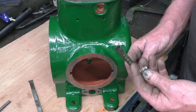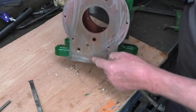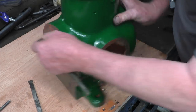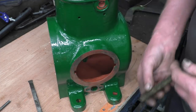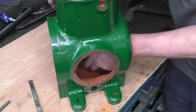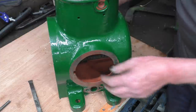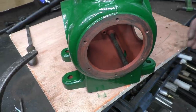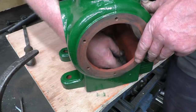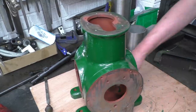This is one of the last parts out and it's only one of the first parts back in — it's the actual oil strainer. It goes along the bottom of the crankcase and connects with that port there, and that's where the oil is pulled into the oil pump. It's spring loaded, one end's blanked off and it's got gauze all the way through it. Spring loaded up against that union — that's the oil feed pipe, always pushed up against that union. That's the first part in.